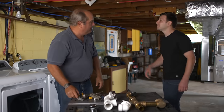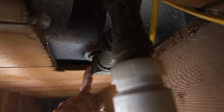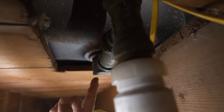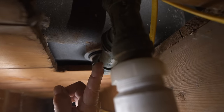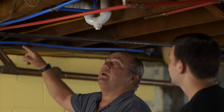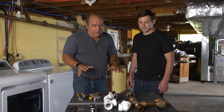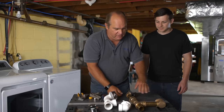Let me look below and see what we have for access. I think we can change this up. I love your basement. So what's the prognosis? Underneath your bathtub you can see here's the bath shoe — that's where the broken screen is. Here's the tee, there's the overflow coming down into a trap, and the drain goes this way. You've got wide open access — we can get at all parts of it, so we can change out the whole unit if we choose to.